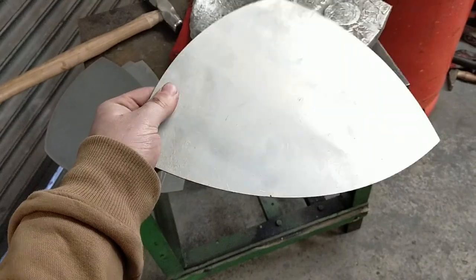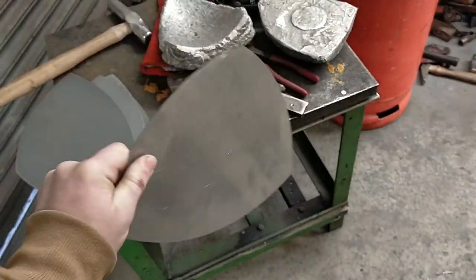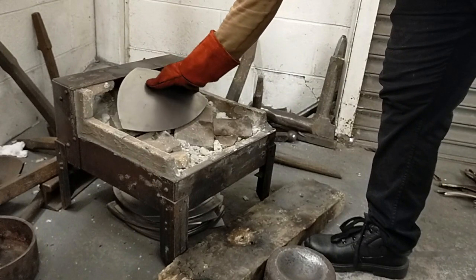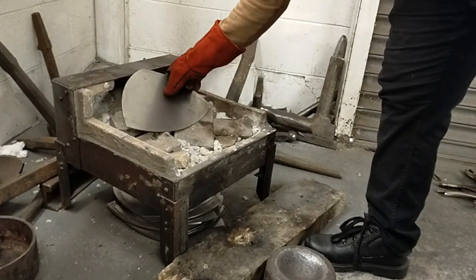You'll want to measure out two triangular shapes of 2mm mild steel with curved sides, measured to the circumference of your head, then half it, with a little extra depending on what type of padded liner you wish to use for your head, then cut them out.